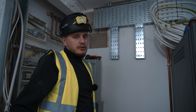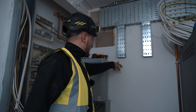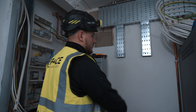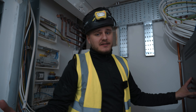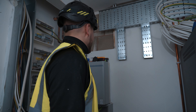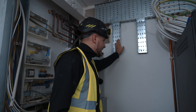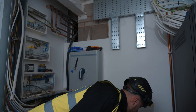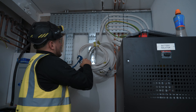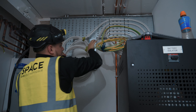Tray's done. You would have seen from the lovely B-roll anyway. But yeah, we've got two drops here. The IPS boards sit about 160. So we've got a little bit of a gap there, and the gland plate's at the back, so that's going to be perfect. We're just routing them this way because we've got a battery rack for a UPS system, which I'm hopefully going to come back and do as well — but that'll be a separate video. Just want to focus on the intricacies of this today. We've got these two stubs of tray, so I'm going to go get my mate Jake and we're going to get the panels lifted into situ. I've got two 10mm supplies for them, and these are the cables to go into them. So we've got all of our circuits for IPS1 there, all of our circuits for IPS2 there, and all of the IPS bonding cables.